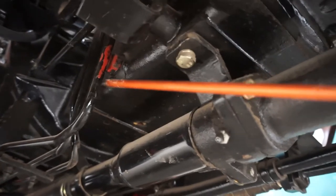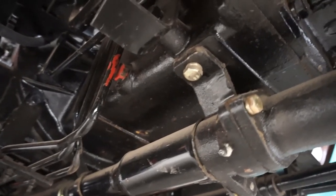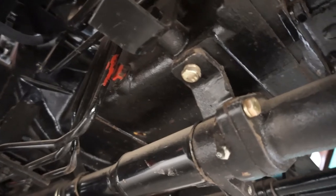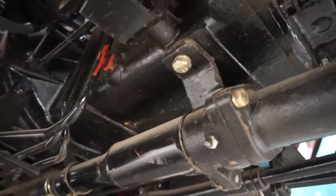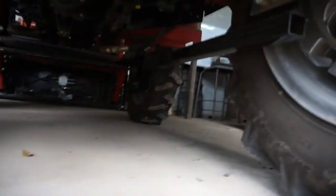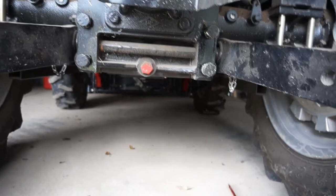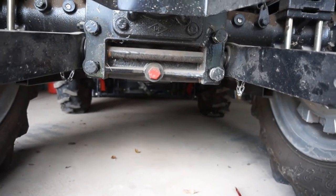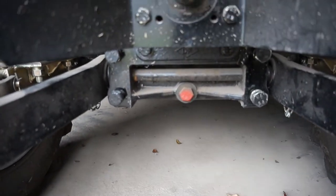But it won't come out because there's a bloody steel pipe there with red on it. So what's the point of that? Either I'm not very bright or that's a design flaw. But nevertheless, if we use the two plugs I've just shown you towards the back of the tractor, and the tractor's on a sufficient lean, all that oil will come out together, because the oil in the gearbox is also the oil used in the rear diff, and the hydraulic pump, all the one.